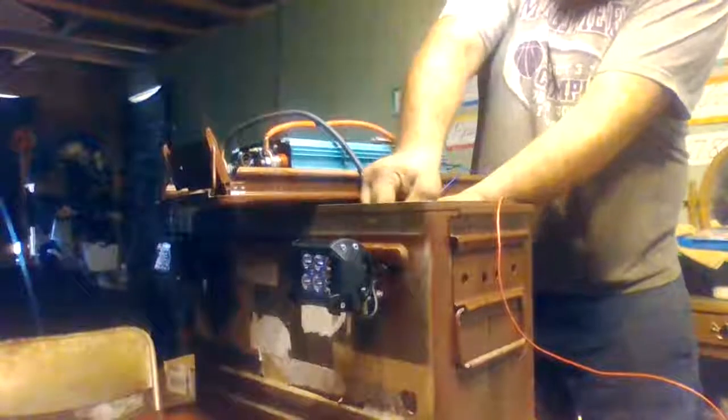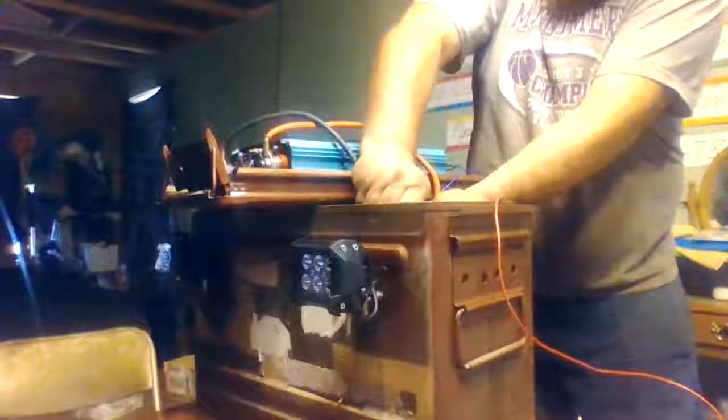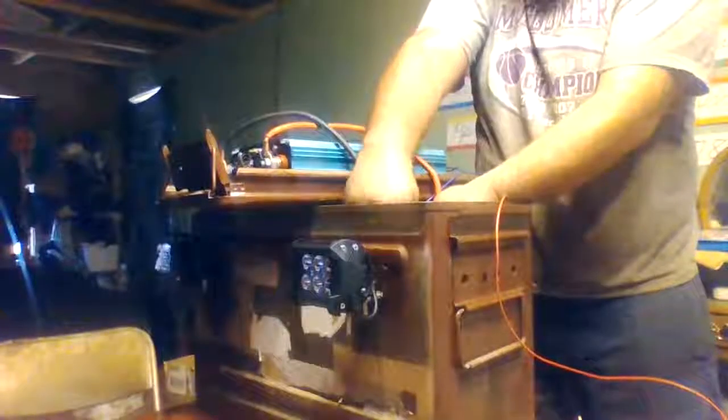But wrap your wires tight, and you can put wire nuts on there if you want. Kind of do whatever you want if you're building it your way. On this, it's light wire, so I'm actually just going to use electrical tape. I don't have any little terminals to put on it, and I could have bought some. Anything that's light 12 volt loads, I like electrical tape. It's not going to burn off. It's not going to melt.